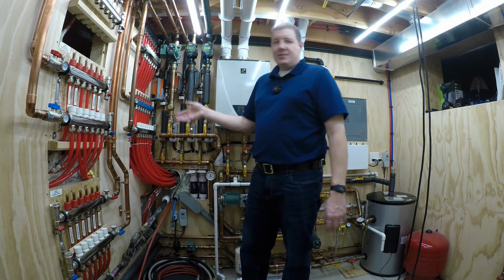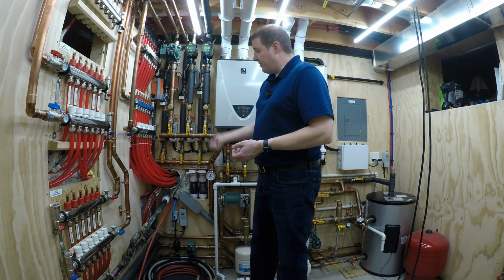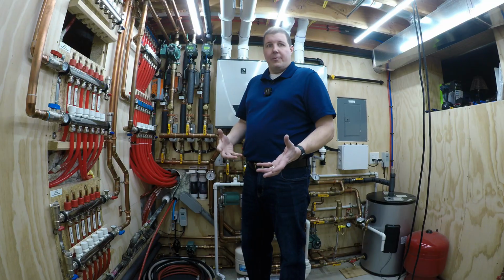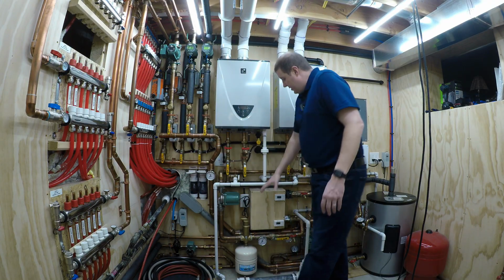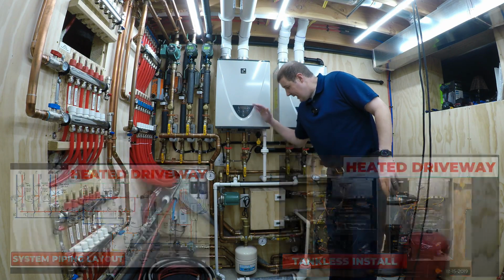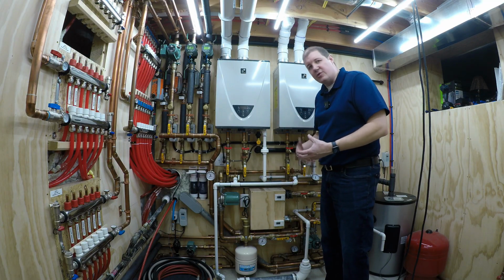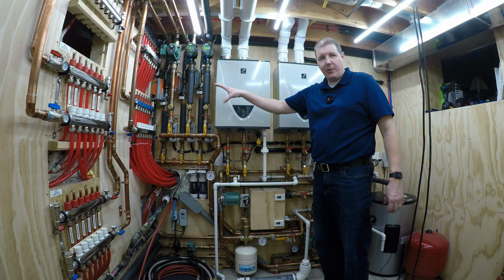So to answer that question, it's all dependent on the temperature of the slab. When you first fire it up, the temperature coming back is colder because that slab's really cold. So the heaters, the glycol running across the flat plate heat exchanger that's in here. Again, I've got a ton of videos, check out my channel. The flat plate can only transfer so much heat over to the secondary side to be put into the driveway.